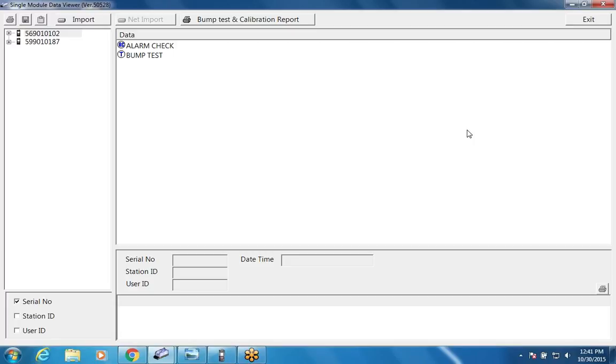So this unit is an expansion module. You can connect up to 3 calibration gases on one dock, but there are some versions of sensor combinations where you might need more than 3. So this is basically a solenoid valve expander that allows you to connect 6 gas bottles at once. I don't know how many combinations there are that require that. There's not very many, but there are some. So this was designed so that with any sensor combination, you can have enough gas bottles to calibrate all the sensors at once. That will connect to your master unit, and then you connect your gas bottles to the side of the valve box. I'll call it the valve box.